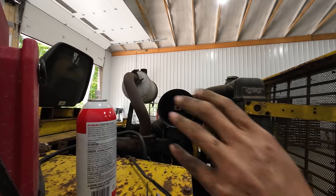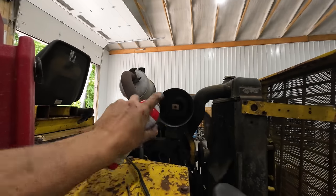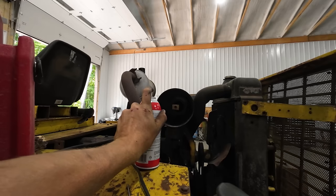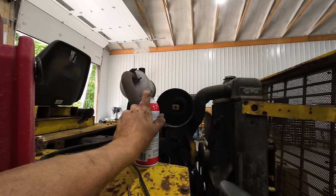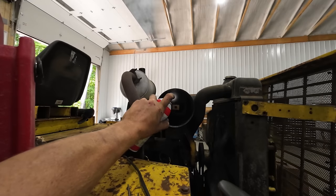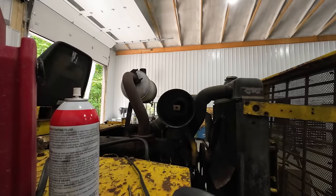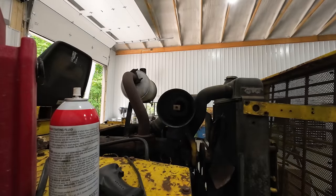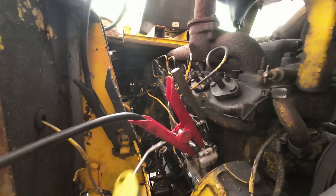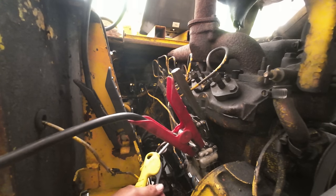Oh boy. The machine actually jumped a little bit. I don't know if I maybe slipped it into gear or what happened there. Oh boy, we're moving. The loader must be in forward. Well, it's a bit of a letdown, but the ether doesn't seem to be doing the trick, so we'll try the compressed air job.